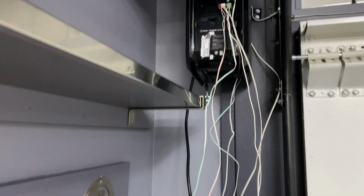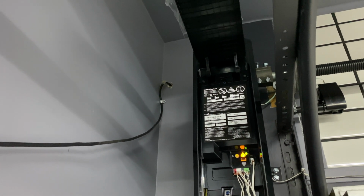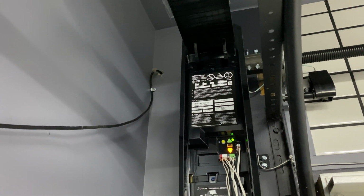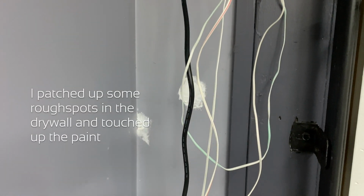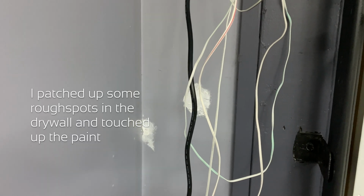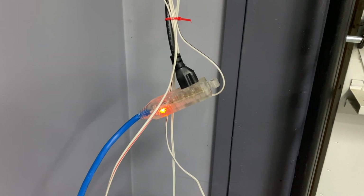So we will be installing a power outlet up there. We're going to come off the ceiling outlet and install a new one, surface mount. But we'll run the wiring through the attic space there. So there'll be a double outlet up there for the security camera and this Liftmaster. Then a little lower, we'll have a light switch that will supply power to the four LED pot lights. And then a little lower, we'll have a double bank of outlets there too.